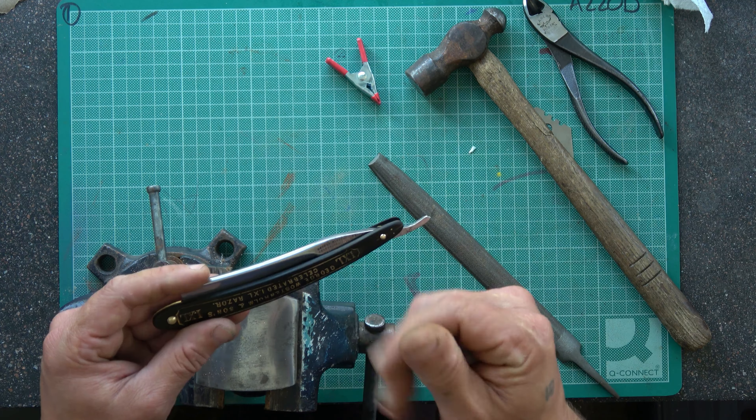That's actually looking very good — some of my better work. The taps are getting even lighter, and sometimes you'd be doing this and as you're tapping, little tiny bits of brass kind of shower off. That's when you know you're doing the real good stuff, because that's almost the pin stock cutting off on the collar. And if you can get that doing that, you know you're going to have a good finish.